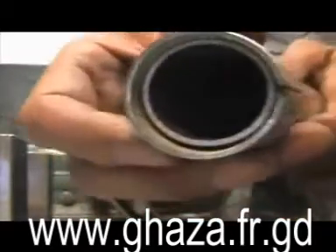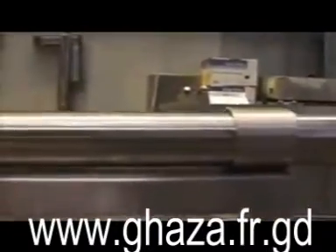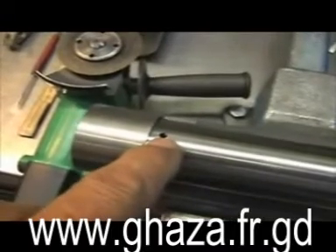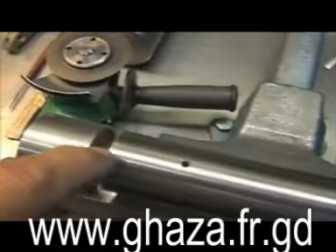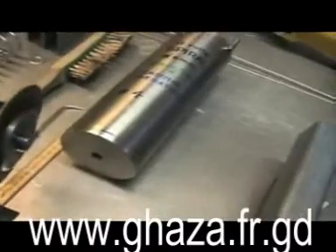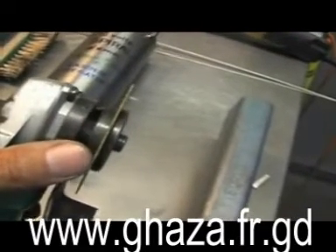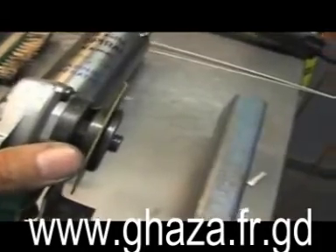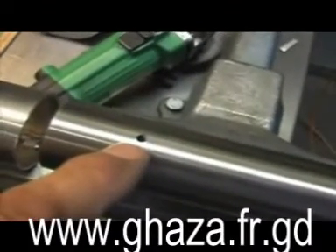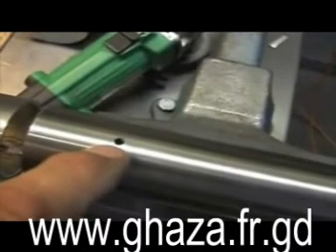And you have a very tight coil. What's important is that you have enough room in between so you can go through with the wire, as you can see. Now I have drilled a hole here — this is about a little more than an eighth of an inch. To cut it open towards the end, I suggest you use a little machine like this and use a grinding blade. This is a very thin blade, 1/24th of an inch — it's extremely good to cut because it doesn't overheat. Whenever you work with stainless steel and you have to drill holes in it, remember you need to cut in half the speed of drilling velocity that you use when drilling regular steel.